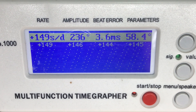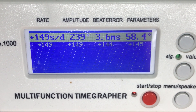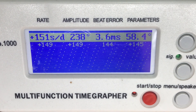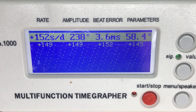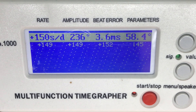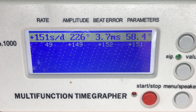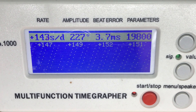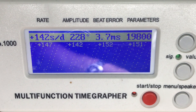Okay Austin, the numbers are okay but they're definitely in need of some adjustment, which we'll do after service. You're gaining a lot of time and you've got quite a bit of beat error — those are adjustment parameters. The one number you definitely want to look at is the amplitude. Although it is running around 220s, for a watch like this it should be in the 260s to 270s. It definitely needs to be serviced. 220s is a bit low for a Belmatic — they're pretty strong runners — so we'll get this going and start the service process.